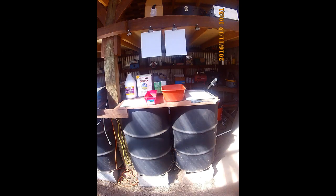This is a picture of the area in my shop greenhouse where I'm going to build my batteries. If I use paper membranes, I'll just dip them in those pails right there, then hang them up to dry on some clips anchored to the beam there. If I don't use the papers, I'll just coat the electrodes right on the table top. I bought an old paper cutter at a thrift store in town for a dollar — it works great, and I'm going to use it to cut my paper down and also cut the graphite foil for the electrodes.